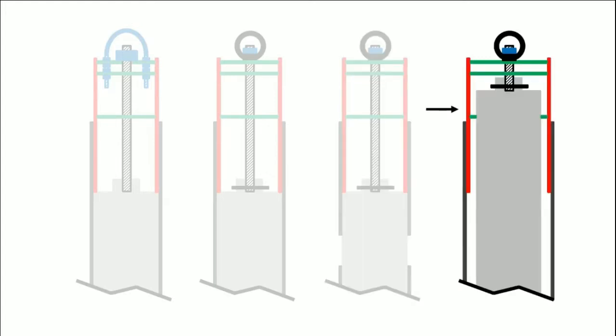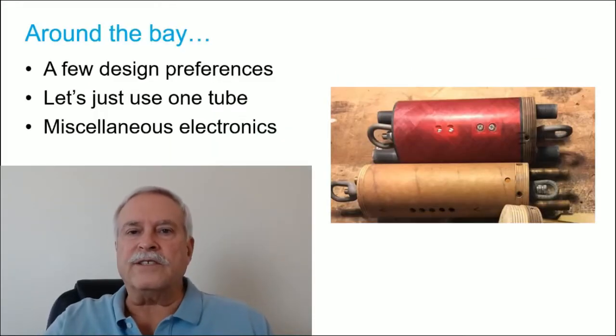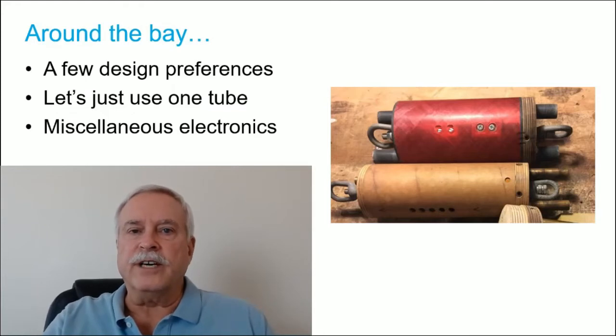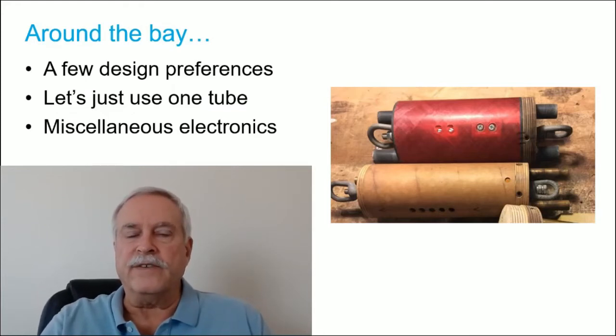The last design option shows how the motor can extend up into the zipperless coupler in a non-minimum-diameter rocket, which can save some space. It always surprises me how many people are unaware of zipperless couplers, so I hope this discussion is useful to those who haven't encountered them before.